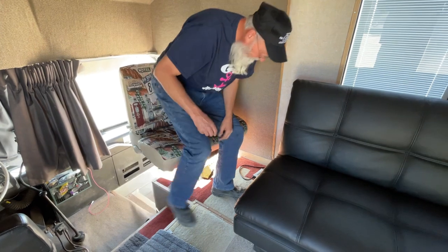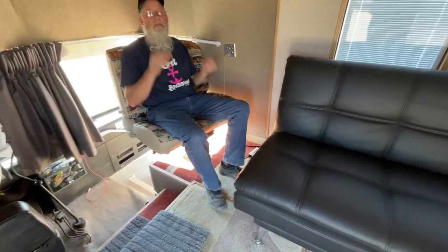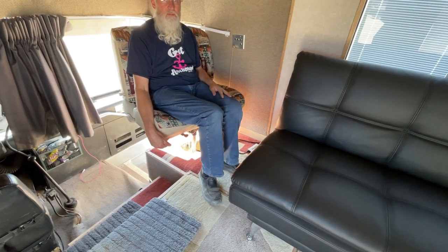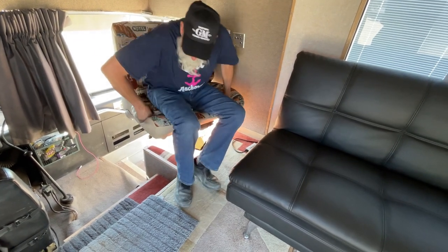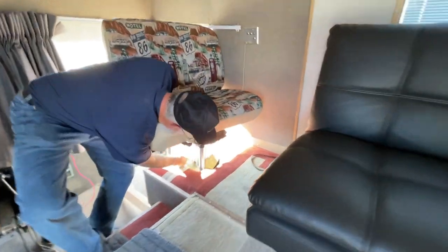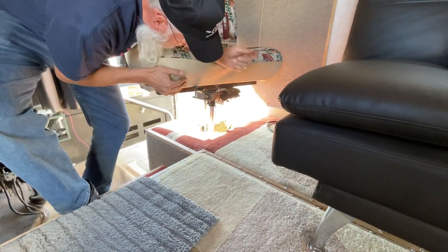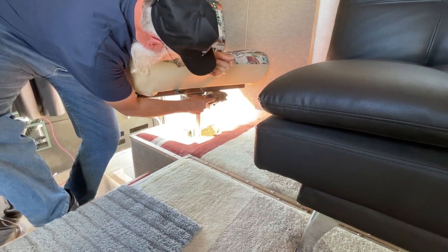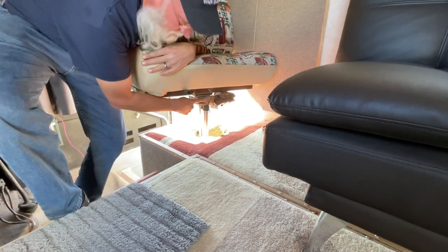It's amazing how fast that is — now it's a living room chair. Originally that couch was going to be on this side but I like it on this side better because of the TV. The bottom piece is a log splitter ram, but the log splitter ram doesn't turn — it's stationary. There's a little rod next to it that slides inside itself to go up and down, and that's what keeps it from turning. Then there's a motor with a gearbox — a screw jack — that's what turns the top piece.